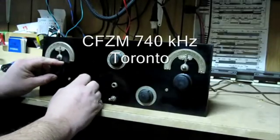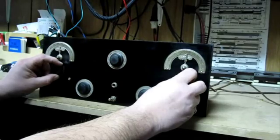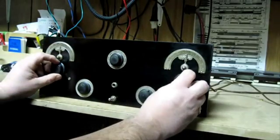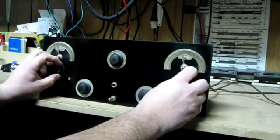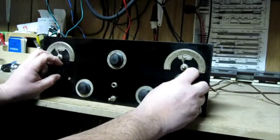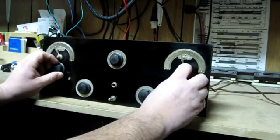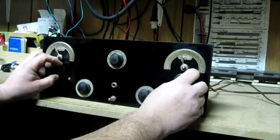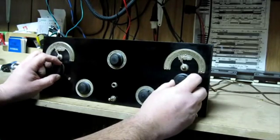We're going to try and find some other stations here — see how far we can go. The antenna coupling coil — a little adjustment to maximize the signal. What you're doing there is actually matching the impedance of the radio with the impedance of the antenna; if you're an engineer you'll probably know what that means. So we're going to have to track these two dials again. In more modern radios they actually have multiple capacitors but they're ganged, and one dial controls all of them at once.